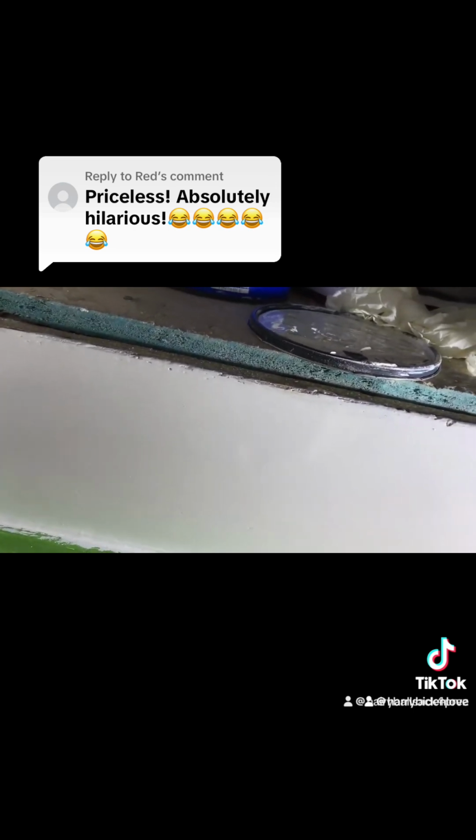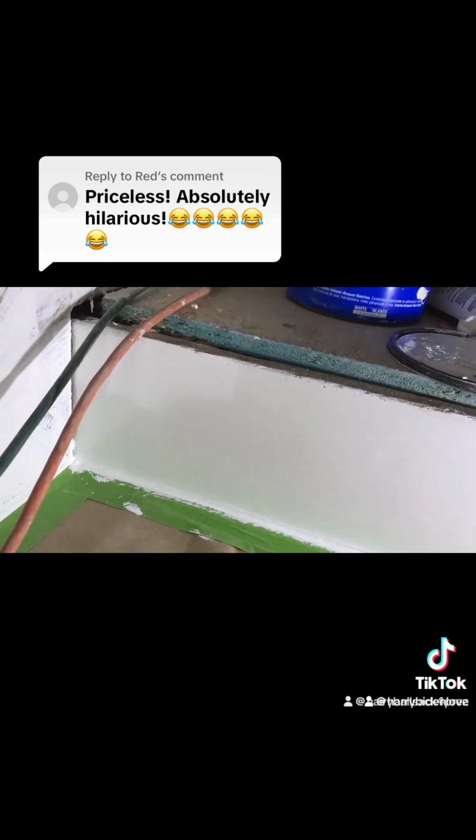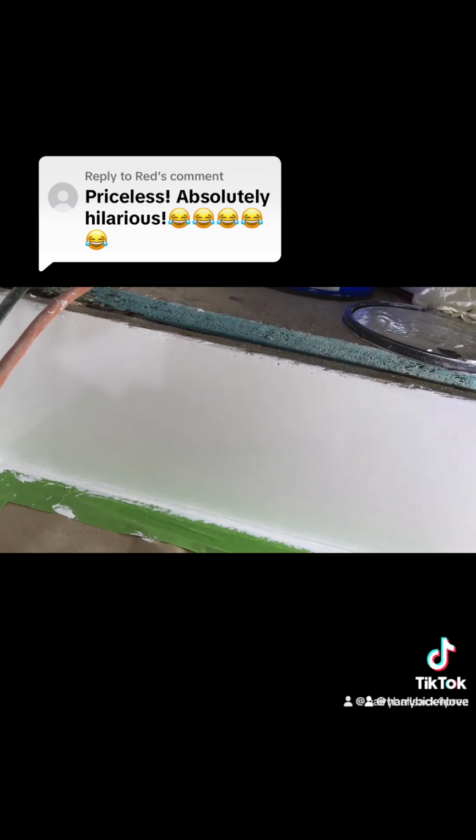Okay, now there's my finish. First coat. I'm going to put 2. After this one, I'm going to buff it and put another coat. Some painters do what they call a split coat. They'll mix the oil base primer with the enamel, and that way you could skip your second coat. It's a shortcut. But I have a little time here because I want to. It's so beautiful. So I'm going to put on my primer, buff it, put on my first coat, buff it, put on my second coat, and in between the first and second coat, we're going to do more repair work.